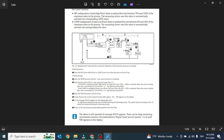Select high or low flow — you should do low flow first. Press plus and the display shows RUN. Press plus again for two seconds. After that it shows zero. When going to zero calibration, the pump should be stopped. Then press the E button and the display shows WAIT. Until it shows OK, don't press any key.